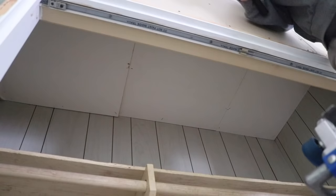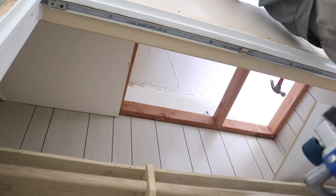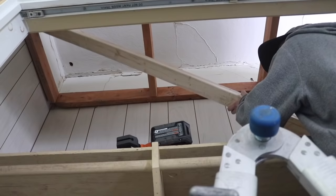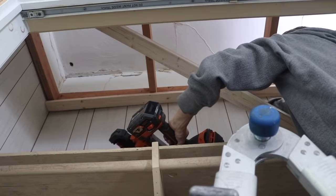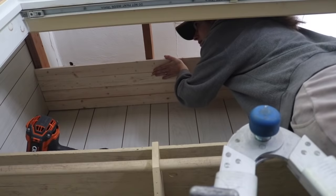Now that I have my built-in closet drawers ready to assemble, it's time to focus on the interior of the closet and making it nice. When I took out the drop ceiling, I noticed the closet had to have been added later because the walls didn't go all the way up to the ceiling. So I popped off the false ceiling tiles and replaced them with furring strips — just slat wood. I thought this would look nicer with my design, and it was pretty easy to just nail up with my finish nailer into the 2x4 structure. I decided not to utilize the one foot of space above the closet for any storage because it's 8 feet off the ground and pretty inaccessible without a ladder.